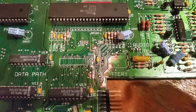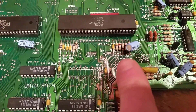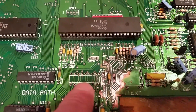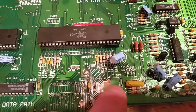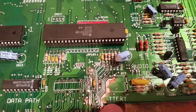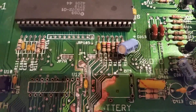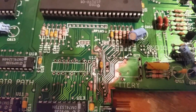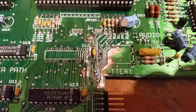Okay, so there's solder flow. It's not too bad around that side. I've done this side up to about there, but I haven't done these yet — I'm missing one whole track there which went up into the solder sucker, so that's got to be repaired. Just check continuity where it hasn't quite met up. That's where some of the solder mask is still on, and where it's like this that's where I never cleaned it up 100%. Just be a bit more patient than me and you should get a better result.